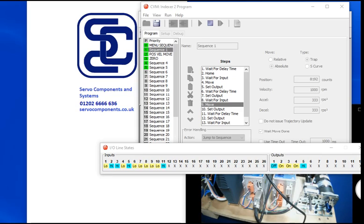Now I'm going to index it, which was input 2. Had to remember myself then. Input 2, it should move to the first position. So you saw it move a quarter of a rev. With a bit of luck this time, it should move. Okay, only one move now. Now when I do it again, pulse input 2 again. There we go. Moving between the two positions.